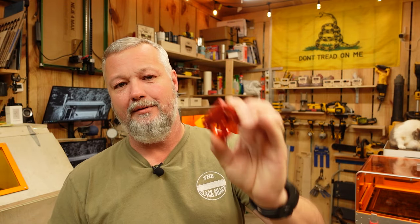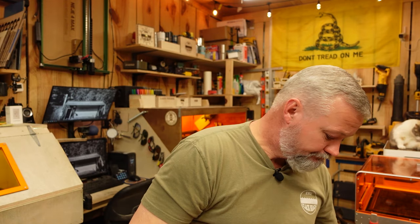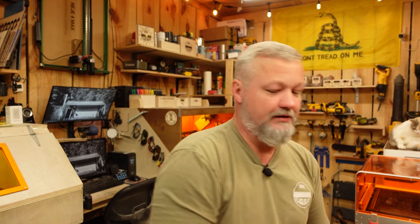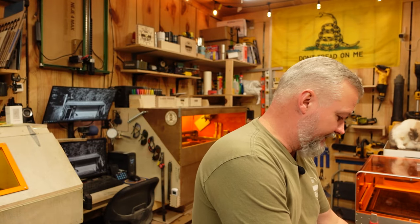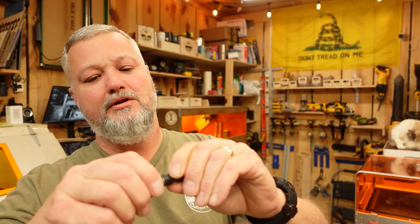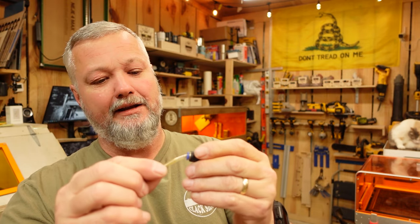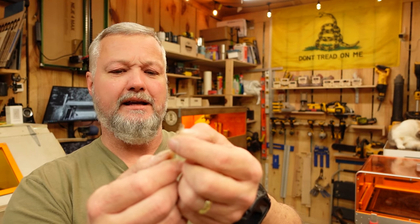The nozzle blows air on or near where the beam exits the machine. To attach everything, I use push-to-lock, pull-to-unlock connectors — the hose just goes in and snaps. Here's an example with a clear hose. If you release one that's been on there a long time, it's sometimes a good idea to snip a little bit of the hose off to make sure you get a really good seal, since it can crimp and cause a slight leak.